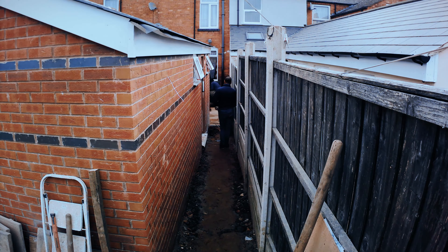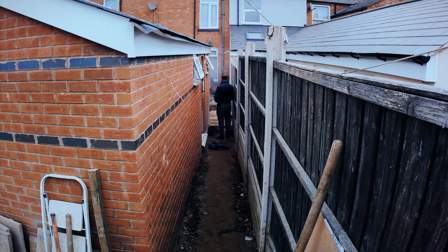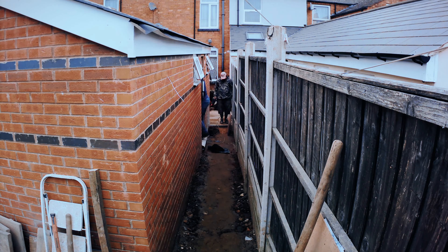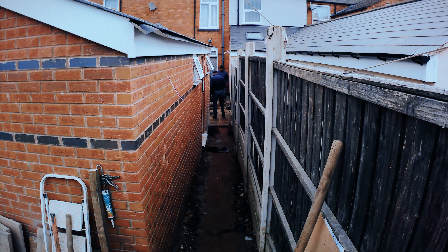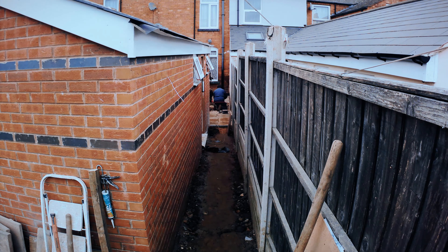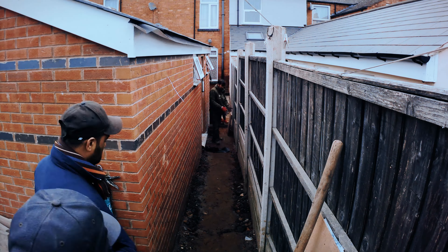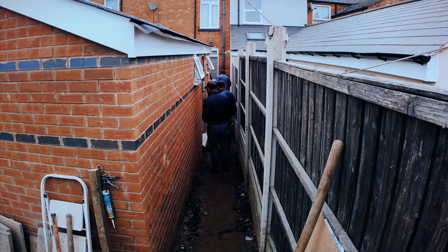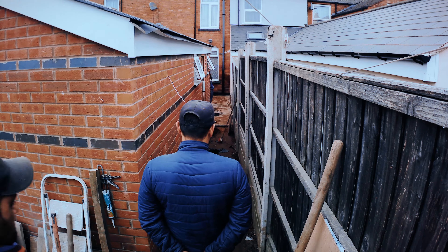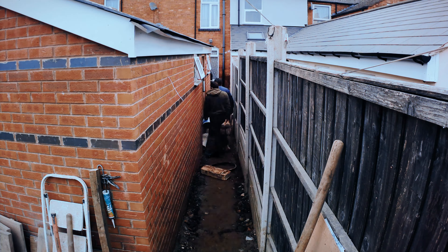You'll see the slabs in the bottom section — we still have a little mini garden because we've made a massive extension, close to seven metres long by three metres wide. All those slabs are basically creating a waterproof area; everything's nicely set up and laid down. The sand has been corrected, and right now they're filling any gaps along the side with a wet cement and sand mix to fill them up, so all the water flows to the side, down the tiles, and into the gutter.